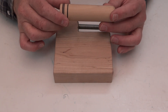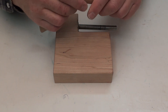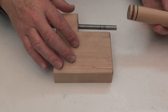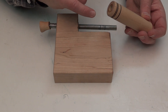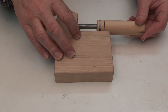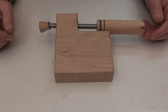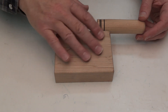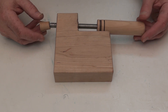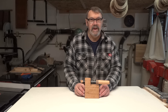The handle is sanded to 280 grit — I think that's plenty sufficient for something that's going to be held in your hand. It's not an art piece, it's a jig. Now I need to put some epoxy in the hole, some on the threads, push it home and let it sit there until tomorrow. Once that is set I will likely coat the entire body, handle, and the little swivel with mineral oil. And that's another project finished.